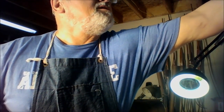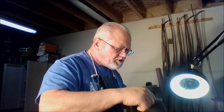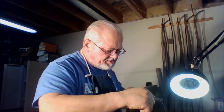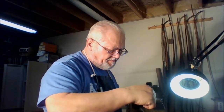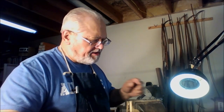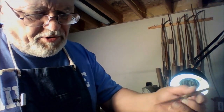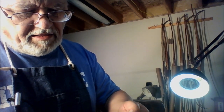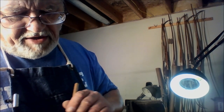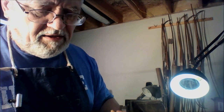We start picking up some pieces, we need to reach over here and get our file card and clean those teeth out. So we'll have this in the soft jaws — it is sitting there just above the steel jaws on the vise — so we're cutting just the receiver and not the vise itself. And now it's a question of how far we want to take this. We want it to look right, but we don't necessarily want to go too far. We still haven't touched metal in here. We've taken a lot of this that was mushroomed over off, and we have moved some metal here, and we're going to have to clean all that up. But we haven't touched anything back here. Now we can go all the way across here — the problem is that it starts looking kind of two-tone. Unless you do it all, it's not going to match.